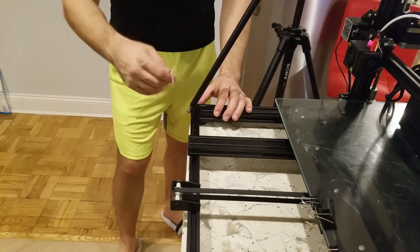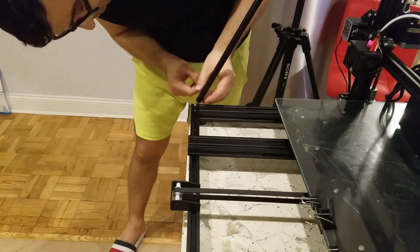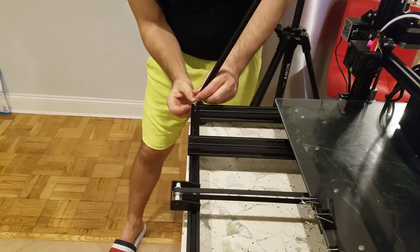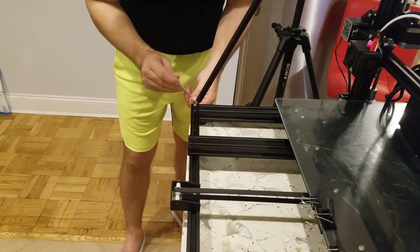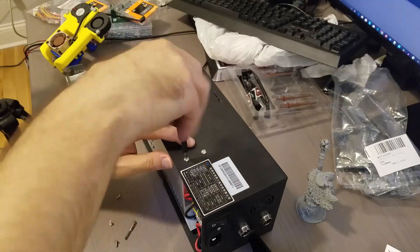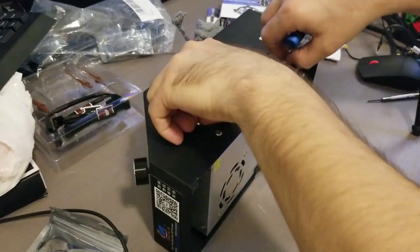As you can see, I am tapping these V-slot rails, but I did a poor job not taking into account the screws that connect the V-slot rails, so I kind of ruined the tap. Eventually I was able to install the Z-axis support rods for large and tall 3D prints to eliminate the vibration at the top.